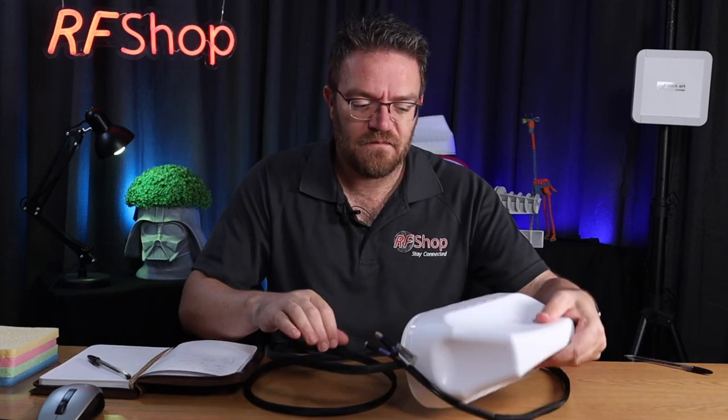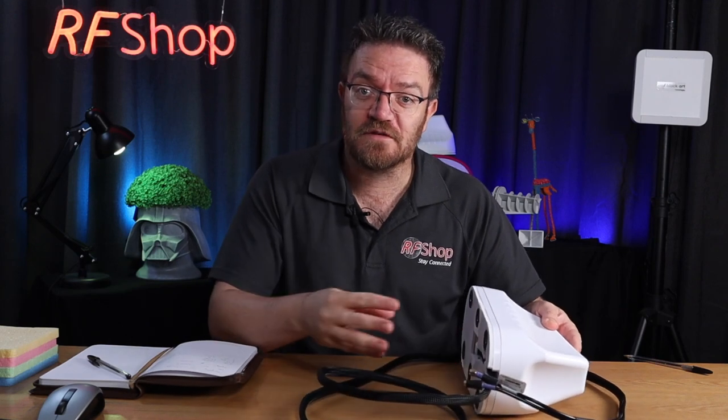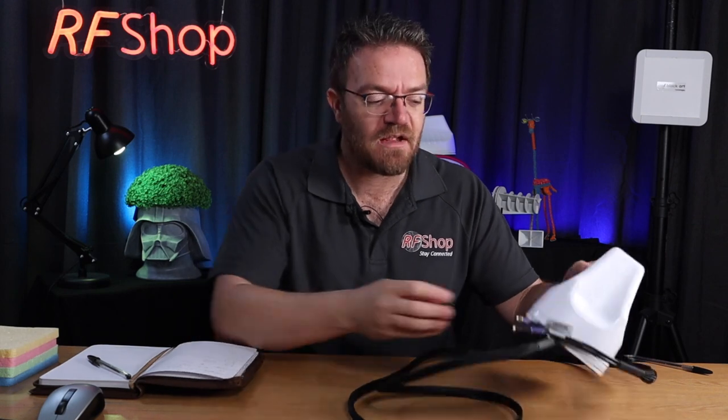There's another thing I've noticed, relevant to us as an RF and coaxial cable shop. The dash-12 comes with a nice thick 195-type cable. But if you need to fit four, five, or seven cables through the same hole and spigot screw mount, the only way to do that is to make the cables thinner. Thinner cables mean more signal loss over even a two-metre cable run. So again: if you only need the dash-12, use the dash-12, because the cable quality will be better.